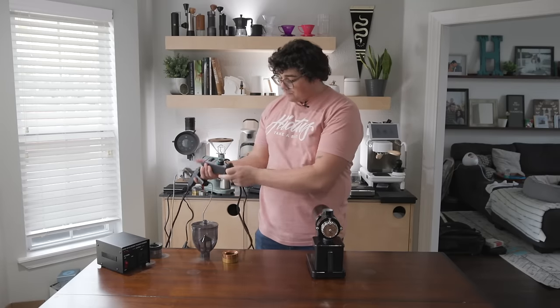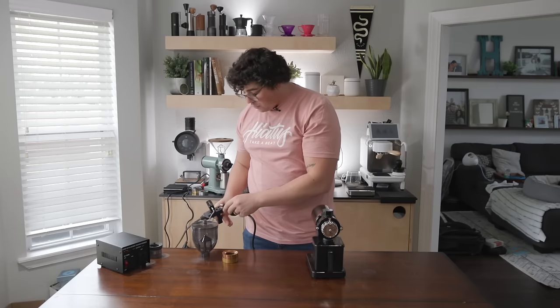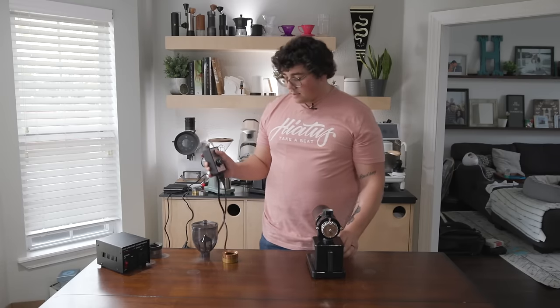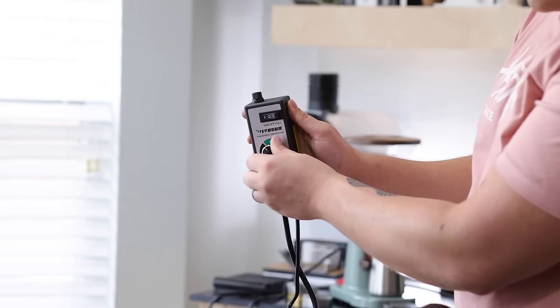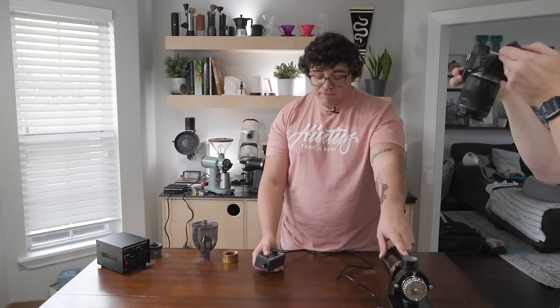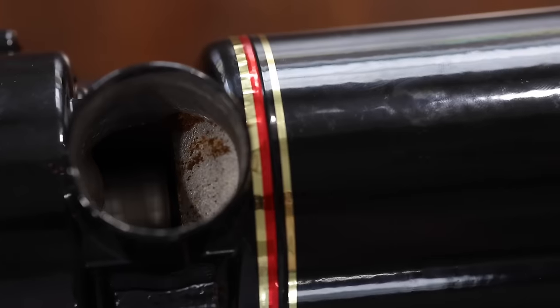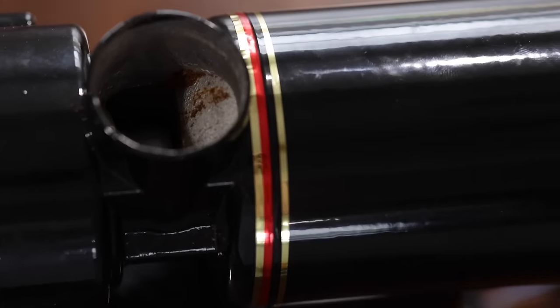I'm going to take the plug from my grinder. I'm going to plug it straight into the router speed controller. Now I'm going to take the plug of that and plug it into the wall or my extension cord. Now what we have is the same thing. I can slow it down and speed it up. All right, what's interesting with this is when you put it on full, you have full power, just like if we had the dimmer and we had it on fully open. But if you switch to variable, and you go to the highest setting, it slows down. And as you go slower, it goes slower and slower and slower. There you are. Back up, that's as high as it goes on variable, and that's at full.